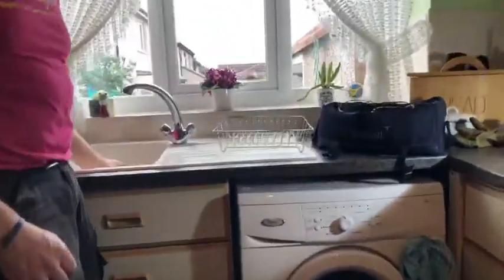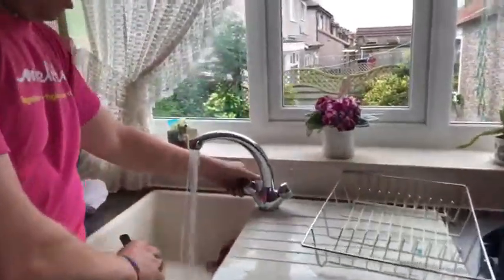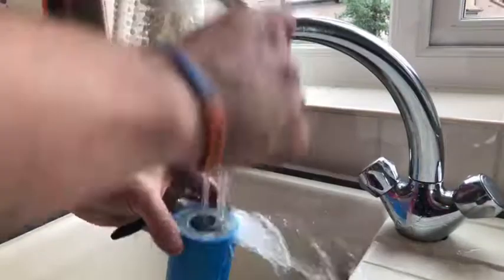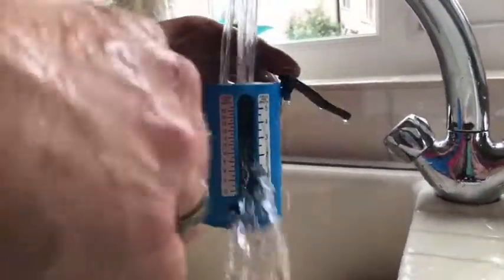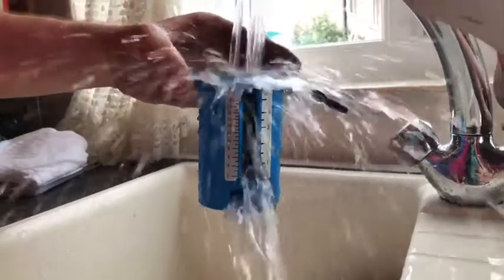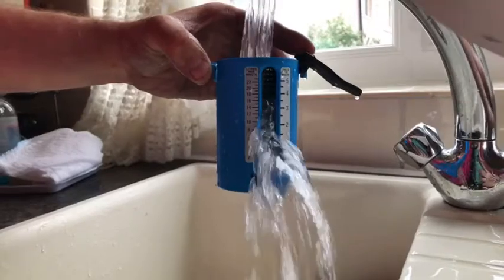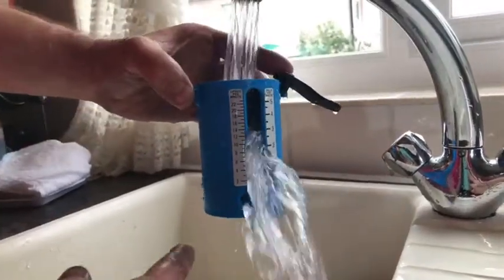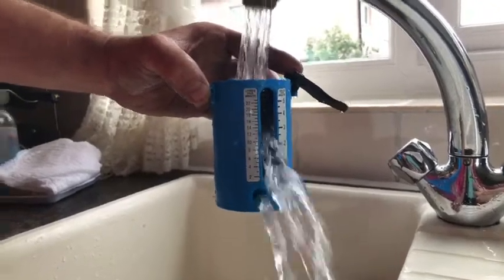We'll open the taps now. Pump's stopped — the accumulator's full. That's the difference. We'll try not to get you wet. I can't even hold the flow cup. So we're getting what — 14, 12, 14 litres a minute now. We'll open the pot as well, so we've got both outlets pulling. It's turned a really poor main into a really good flow and pressure. We've probably got about two bar at this tap now.